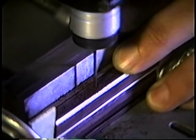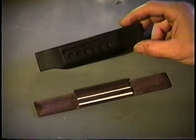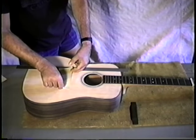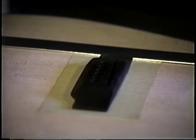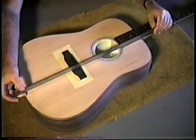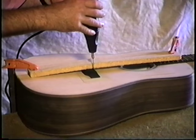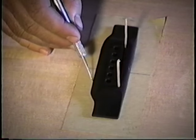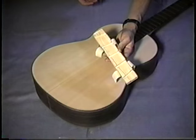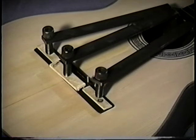After sanding the bridge smooth, we drilled the holes for the strings. We had to decide whether to glue bridges on before or after applying the finish. We didn't want finish on the steel string bridge, so we glued it on after finishing, first applying masking tape over the bridge area and carefully positioning the bridge. Once satisfied with the location — just slightly beyond scale length — we immobilized it and drilled holes for toothpick positioning pins, which kept the bridge from sliding during final gluing. The classical bridge was glued on now so it would receive a finish along with the rest of the guitar.